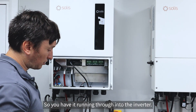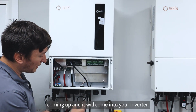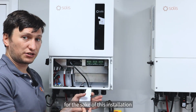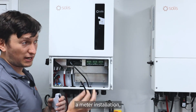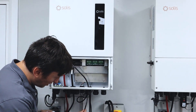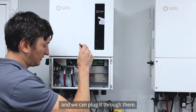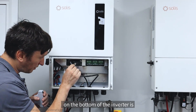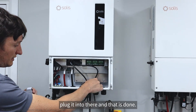The RS-485 cable runs through into the inverter. For this installation we're treating it as a meter install even though the grid connection is within five meters. The cable goes through the same gland as the BMS CAN cable, and then plugs into the second RJ45 — the black RJ45 on the bottom of the inverter. Plug it in there and that's done.